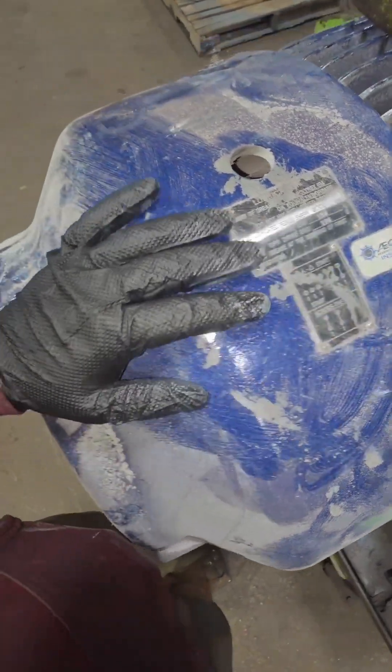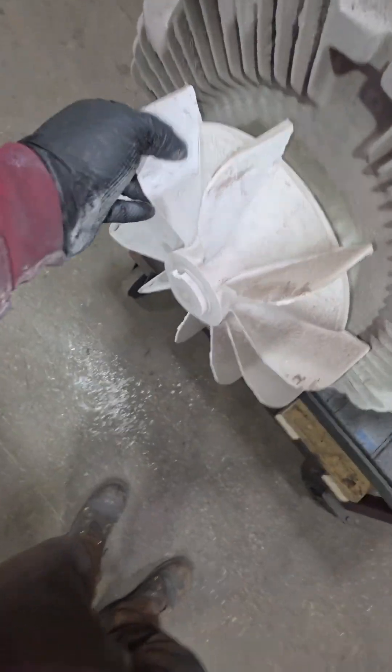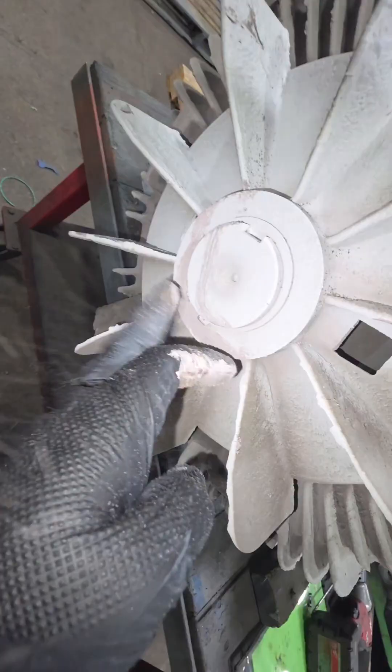I love these electric motors that have tons of information on the tag — it tells you how many grams of grease you need to pump into this thing after so many operating hours. And if you're thinking you don't know how much grease you pump in on your grease gun, it's measured in grams, so go ahead and get yourself a scale, take one pump of grease, see how much it weighs, and go from there.